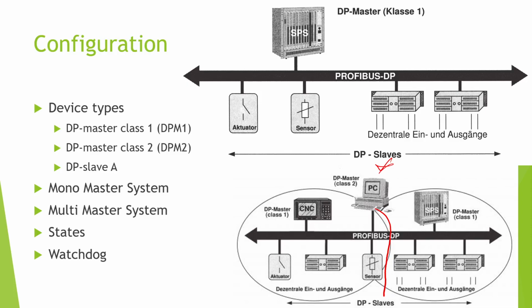Same with a reset system. This is definitely one of those things that I don't put into my code. I'm not programming some crazy things. But being able to reset your system is going to be super important, because think about that. You're running your system and a piece gets stuck and it breaks. Well, if you just remove that because it's broken and hit go again, that one station is expecting that DVD box to show up, and it's never going to show up. So it's just waiting for it, and everything before it is waiting for that one to do something. So you need to be able to say, yep, reset, remove this item or whatever the case is.